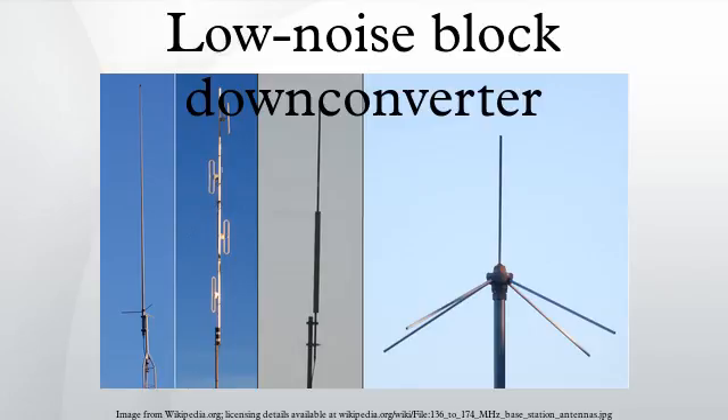Every LNB introduces some noise, but clever design techniques, expensive high-performance low noise components such as HEMTs, and even individual tweaking of the LNB after manufacture can reduce some of the noise contributed by the LNB's components. Every LNB off the production line has a different noise figure because of manufacturing tolerances. The noise figure quoted in the specifications, important for determining the LNB's suitability, is usually representative of neither that particular LNB nor the performance across the whole frequency range, since the noise figure most often quoted is the typical figure averaged over the production batch.